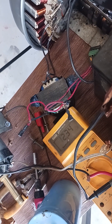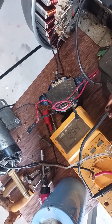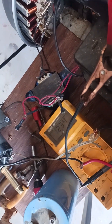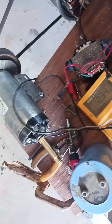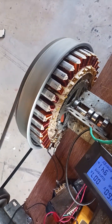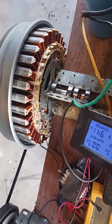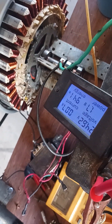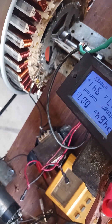Anyway, you know me — I ain't much for answering questions and stuff. But I'll see if I can get a schematic of this drawn up and I'll put it out on my web pages in case anybody wants to play around with it. Not much to it though: standard treadmill motor, flat belt, and rewired motor. Add a few magnets — you don't even have to add the magnets and it'll put out; it won't cog as bad. But I find that the same amount of magnets for the same amount of poles: you get more cogging but you get more power.